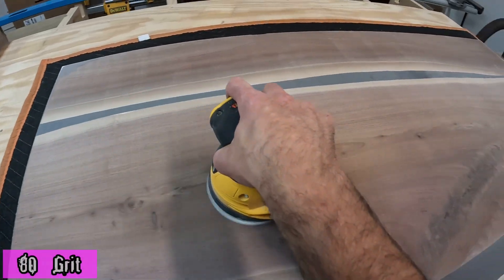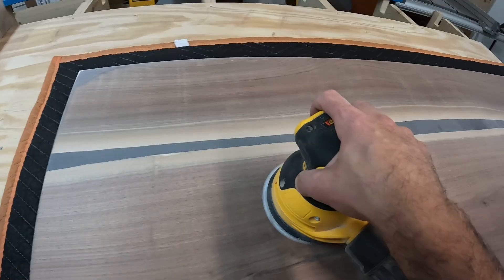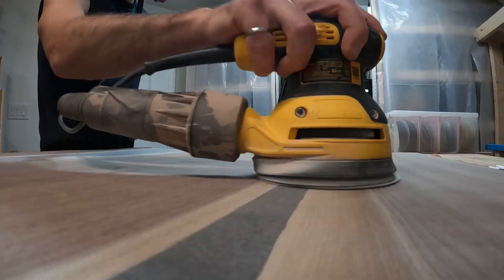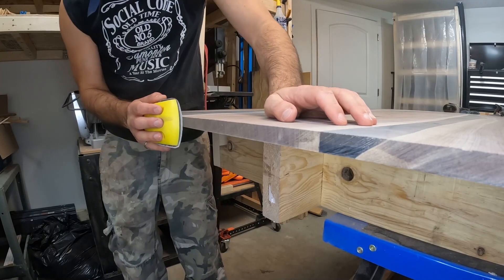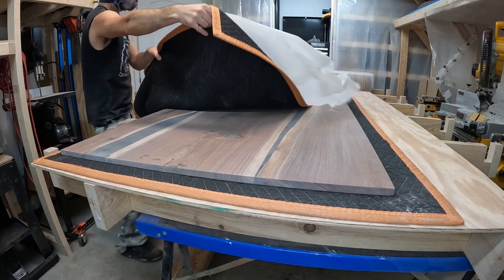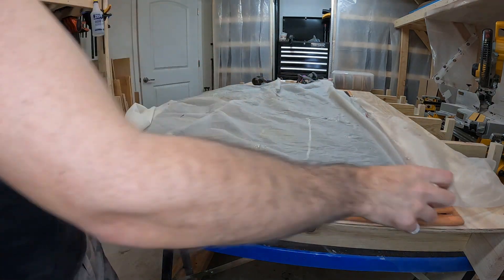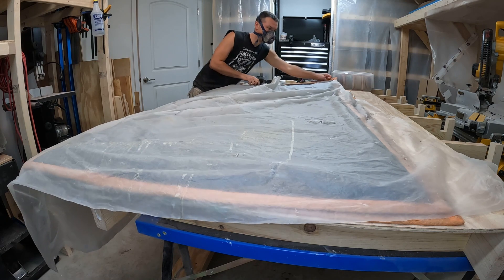Probably not something I'd do again. Once I had the majority of those machining marks out, I switched up to 80 grit. The 80 grit does a good job of taking out bigger scratches, so I really took my time there and that got everything out on the top and bottom. For the ends and sides I like to use a hand sanding block — I get a little rounding on edges with the orbital, so at the lower grits I prefer the hand block to keep things nice and straight.